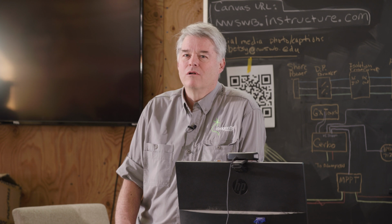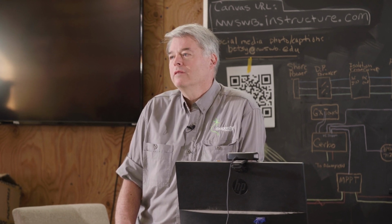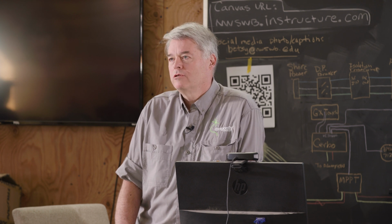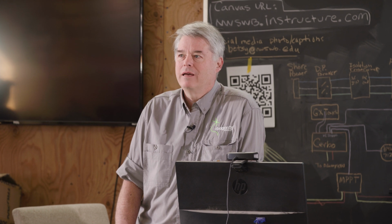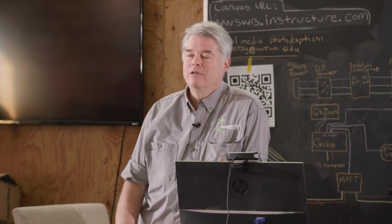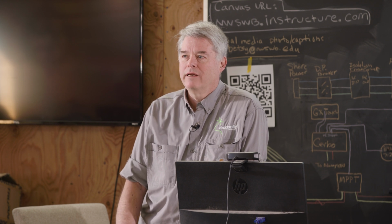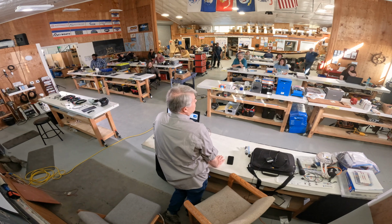In the real world, the most critical thing is anything with a motor, and there's something known as locked rotor amps. If you can't find a spec, and I'm going to look for confirmation because I'm going out on a limb here, I would say if this thing says it draws 10 amps, just plan on a 20 amp surge. I think that's a pretty good rule of thumb. We're going to double whatever that amperage is for the first few seconds, if they're not going to tell it to you.